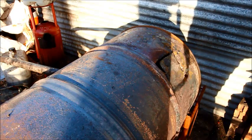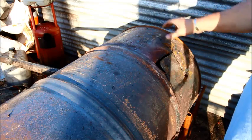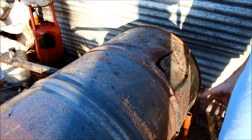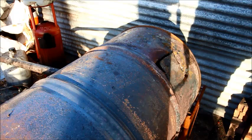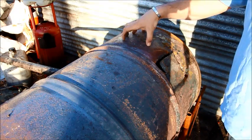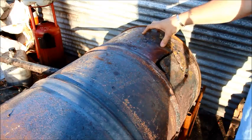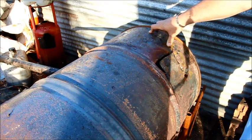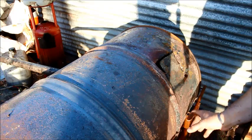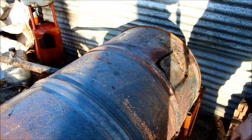That chimney is going to radiate a lot of heat — particularly if you put a little fan blowing along the length of it, moving air will take a lot of heat with it and you're going to get much more of the heat you've already generated into the space you want. A lot of people have the chimney coming out the back at the top, so heat goes straight out the chimney and bang, out the wall. For me, the coolest point is at the bottom, so I duct the chimney out the bottom and make the chimney run as long as possible inside the building to extract the most heat.